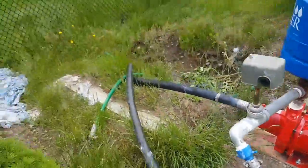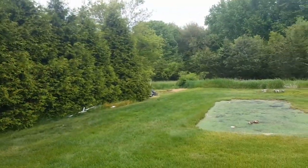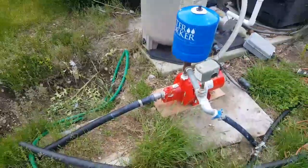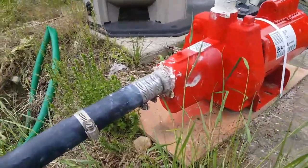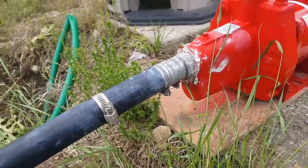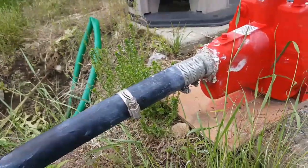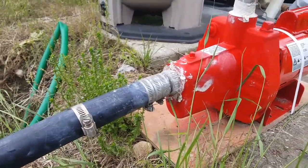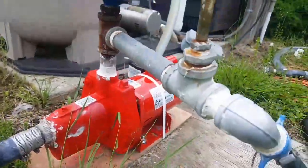I have 100 foot of 1.25 inch pipe, as you can see, all the way down to my 15-foot well, way the heck down there. It's still open, you can see. And I have a 1.25 inch pipe. I first installed it with a 1.25 inch brass male insert into male thread, and I didn't do too good a job. It wasn't tightening, it was old, so I actually used a 1.25 inch plastic insert and cranked it down. As you can see, not a drop on this thing.